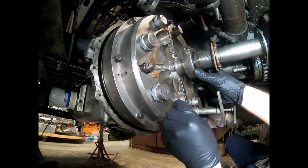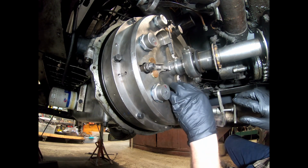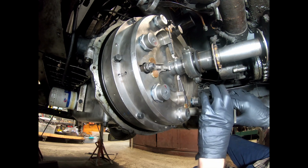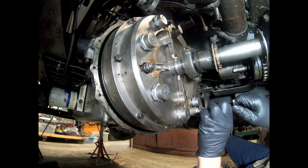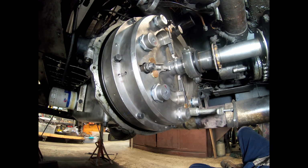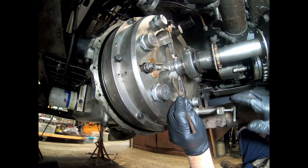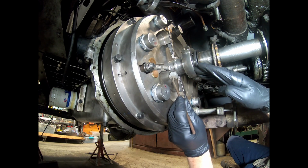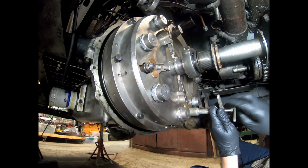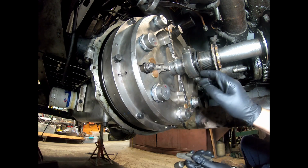So now I have one of these levers set using the factory tool. So I have that distance there. You bring the lever out. See that little bit of movement there. All right. That's a little wide, but it's a good place to start. So then we lock the lock nut. And so now we have this one set.